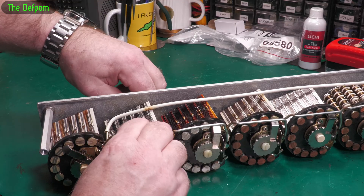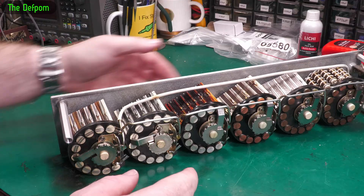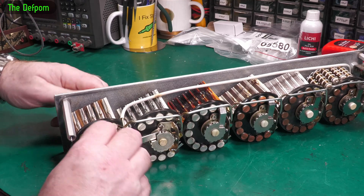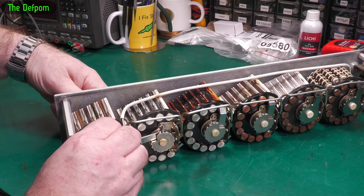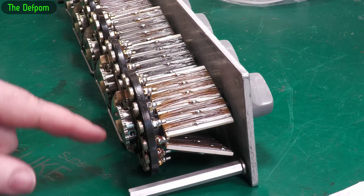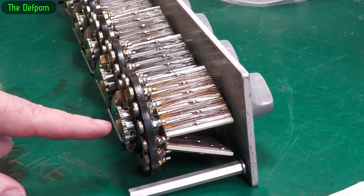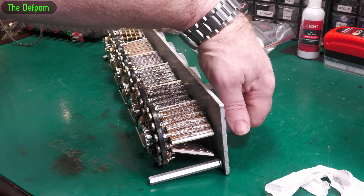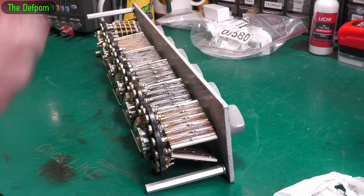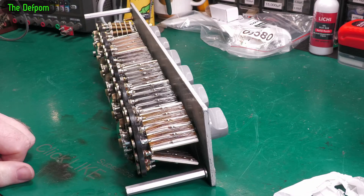Very gummy, though it is turning now. I'm going to get in here and put some thin oil into each of those. It's a plastic shaft going through. I'm hoping if I put some thin oil in there it'll free it up. It's got some grub screws on this collar going to that shaft. I think I can loosen those grub screws to free the shaft so I can pull the knob right out. It might be gummy from the shaft going through — I can put some silicone in to lubricate the plastics. I'll pull it apart first.